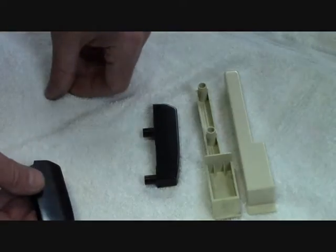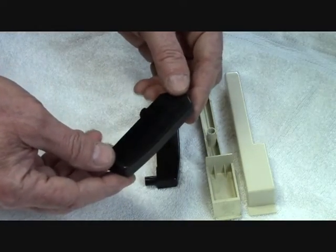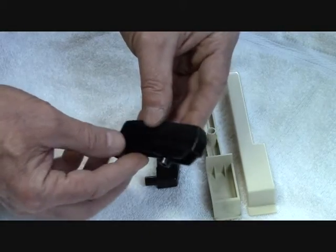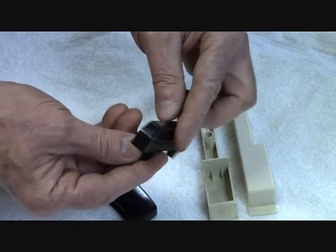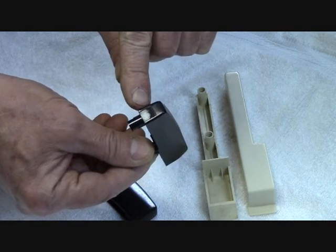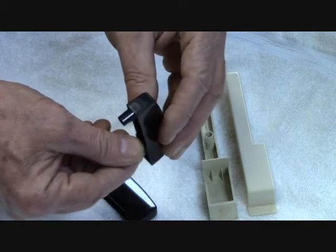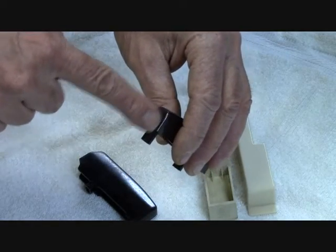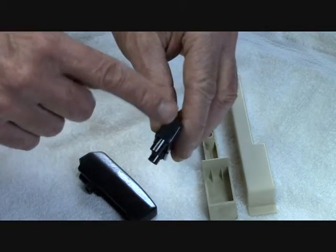Because those processes are different, there are telltale signs on the pieces you can look at to determine what type it is. If you look on these parts, you will notice that they are smooth on all sides. But on the back of a thermoplastic part, you will see what appears to be a break or where something might have been attached and broken off. That is the sprue — where the plastic was injected into the cavity — and it leaves an impression there. So if you look at the back of the part and you see that mark, you know you have a thermoplastic part.